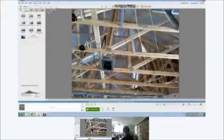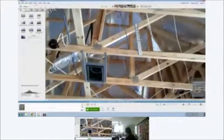Then what they do is take these little rulers and tape them up in what will be the attic. That way after they spray the insulation into the attic, an inspector can come and make sure they put the right amount. It goes up to 20 inches so they can measure that the insulation reaches the right point.